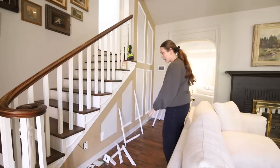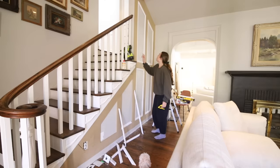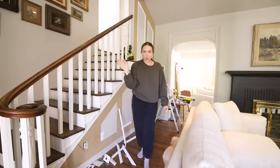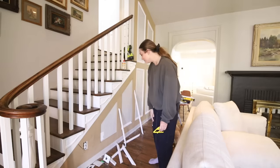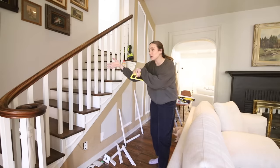Of course I bought the inexpensive one because I was like, I don't need a digital, I mean, yes, but whatever, this was cheaper. I had to buy a protractor so that I could figure out the angles because there are so many angles on this thing. Angles here, here, there's a couple up there going down. These were the only two that were perfectly square that I just needed to cut 45 degree angles. I had to do it by hand because some of these angles I couldn't even get in the miter saw.